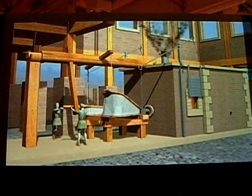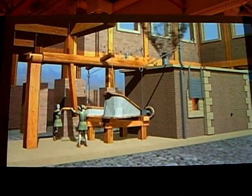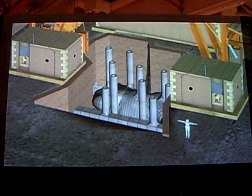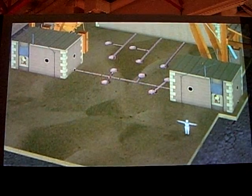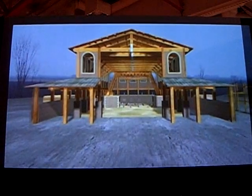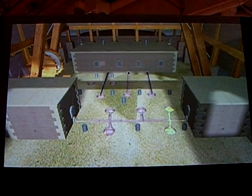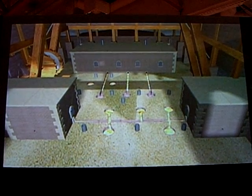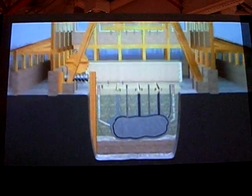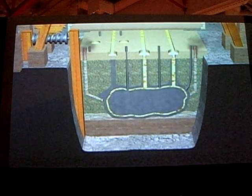Meantime, on the surface, the ironsmiths fire the furnaces to the required temperature and sample the bronze to verify the homogeneity of the alloy. Once the pit has been entirely filled and packed down, the channels through which the bronze flows from the furnace mouths into the mold are positioned. Everything is now ready to carry out the casting procedure. The stoker opens the first furnace and the molten bronze begins to fill the mold. The furnaces are opened according to a determined sequence, controlled by pyrotechnic sensors, which fire as the molten bronze reaches them, sending out the signal to open the next furnace.